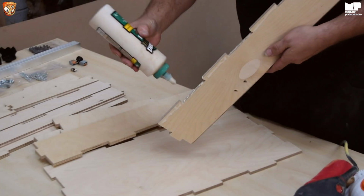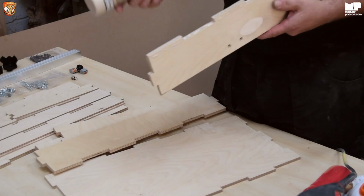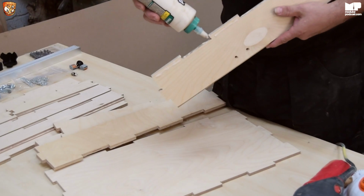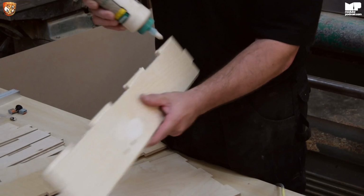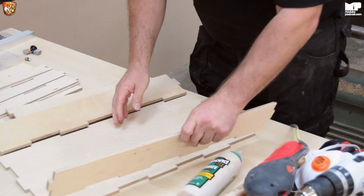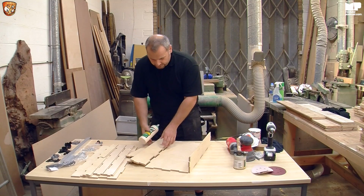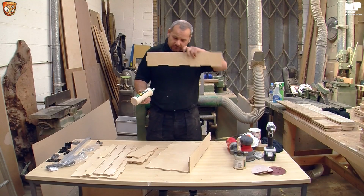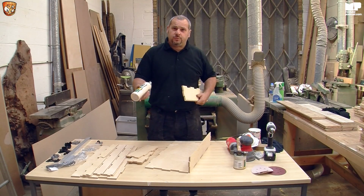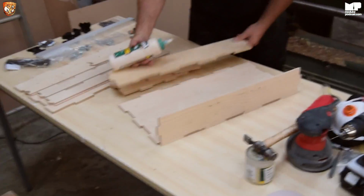And one little tip as well is, because box joints give you more surface area to glue, which is why they're stronger, you just put a tiny bit on each edge, just here, so when you do fit it, every single surface is being glued properly. And one of the reasons I designed this like this is for strength, because you'd be gigging with it, taking it to your friend's house, and it's convenient to put it in the corner and just grab and go.